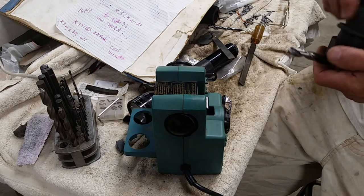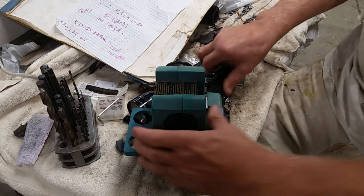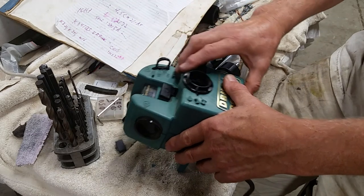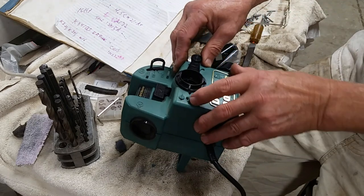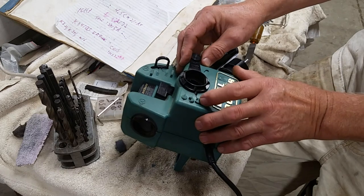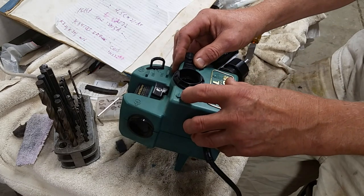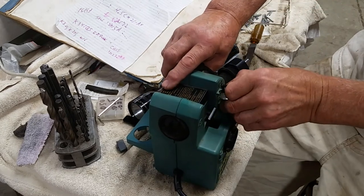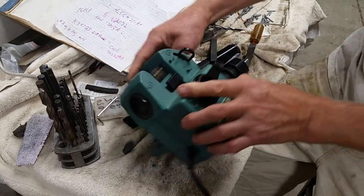I'm going to try the half-inch drill. The video has a plus and a minus indicator here - it doesn't show the three different tip types. But if I want more of a ramp or rake on the back, I'm supposed to slip it up to the top one. I think that's for 118 degree, and this is 135, but I don't really care - I'm going to stay with the 135.